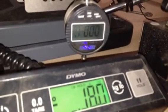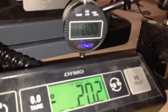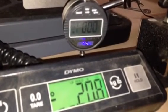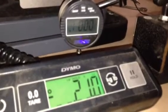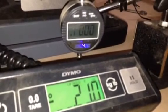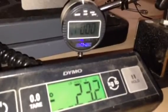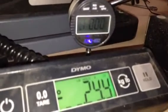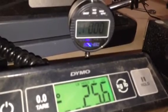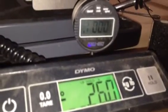Now we've got a thousandth of deflection at 18 pounds of pressure — that's quite a bit of pressure. We're at 20 pounds. These stepper motors are 381 ounce-inch motors and I'm using a TB6560 4-axis board. Again, it's a 36-inch model, measured in about the middle of the gantry. Still at 0.001 inches.